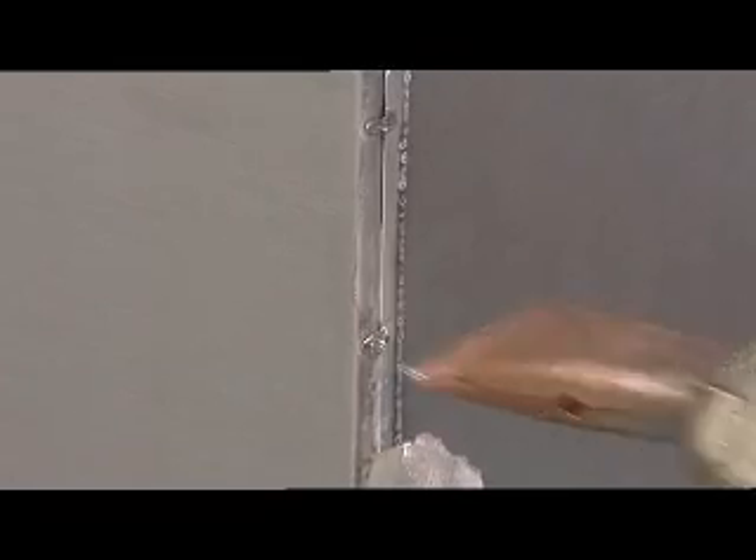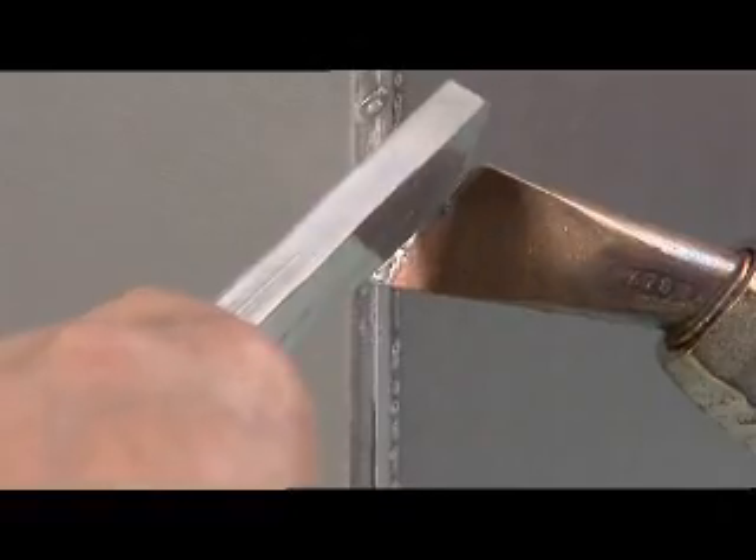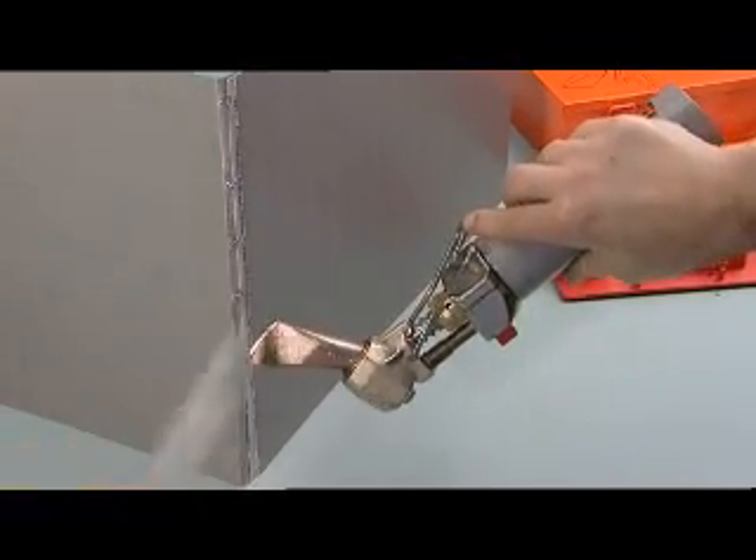For angle soldering: tacking, smooth soldering, applying another coat of stripper — the roofer applies soldering metal every 5 to 10 millimetres. He then reinforces this soldering with short horizontal lines or spots.